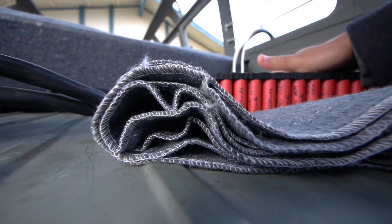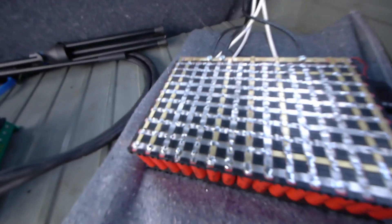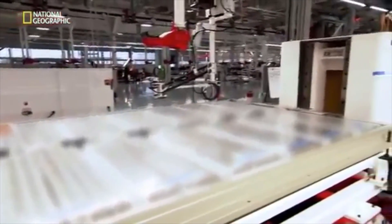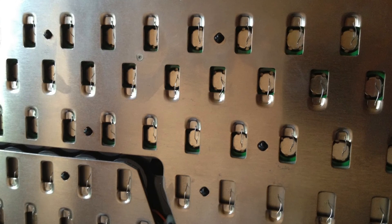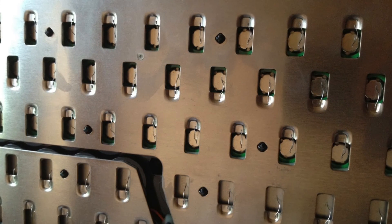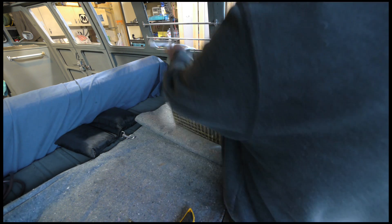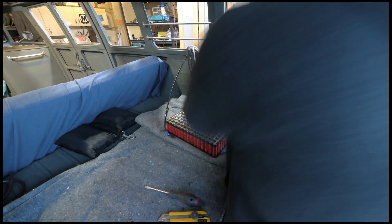One of the challenges with these type of cells is that they are not as safe as the iron phosphate ones. The higher energy density of this chemistry makes it more prone to catching fire. Tesla has designed very clever ways to build safety features into their battery packs. One of the most unique and clever safety features is a cell-level fuse used in every battery. Each one of the 7,000 cells used in the Model S has its own fuse designed to blow if the cell develops a short circuit. This feature is very important, especially in my case since I am using all recycled cells, so I have decided to experiment to develop my own cell-level fuse system.